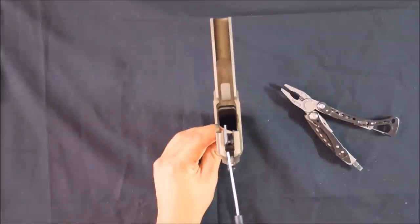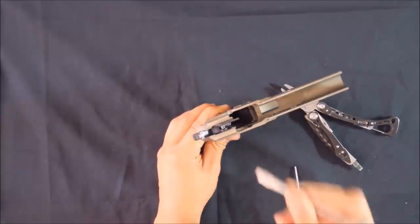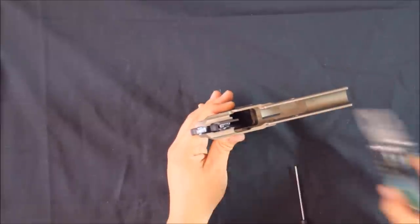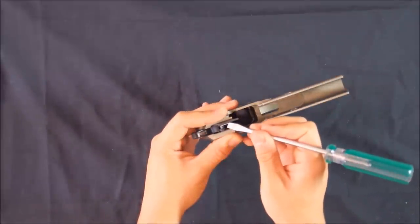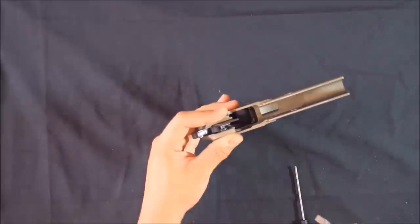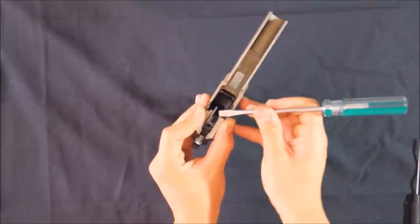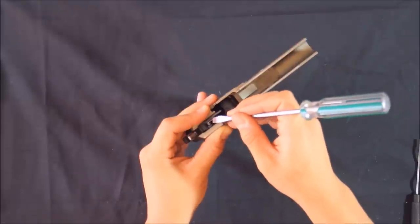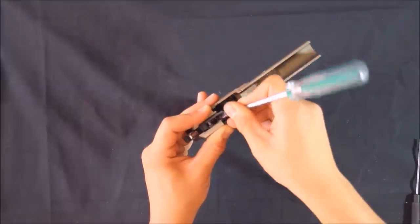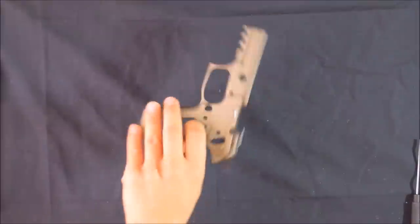Just recapping: the ejector, the sear, the sear spring, and then the firing pin block disconnect on the right side. The hammer should sit as shown. Now we need to put tension on this spring — put it back underneath that roll pin. Once this has tension on it, none of it will fall out. So grab a flat-head screwdriver, put your fingers on either side of the pin so it definitely won't come back out, then grab the spring arm and drag it down, across, and under the pin. Doesn't require force but it's just a bit tricky — try a smaller screwdriver.